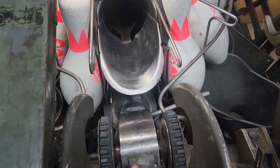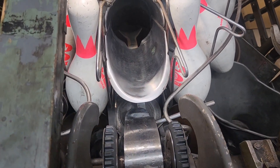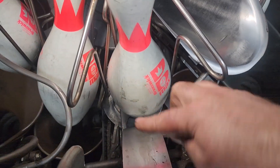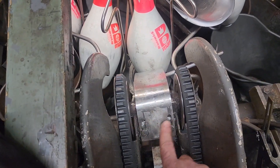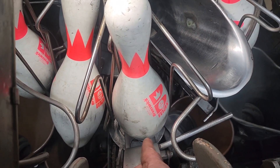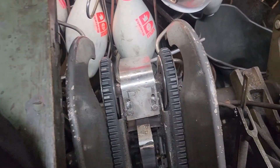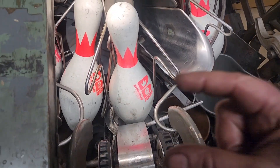The other thing is that this had a huge gap between the belly of the pin and the snubber. Back at the number 9 position, we still have kind of a big gap. We're at the end of our slots — we can't go further that way — but what we can do is try to bend it up. We want about an eighth of an inch gap; right now we're looking at half inch to three quarters. The rubber pad that goes in here is also missing, so putting that in could help lift it up and shorten that gap.